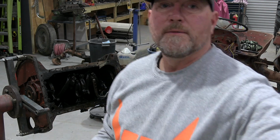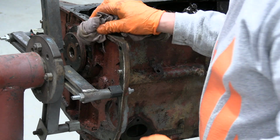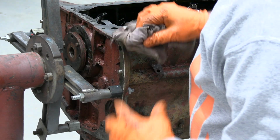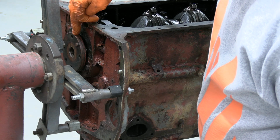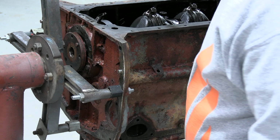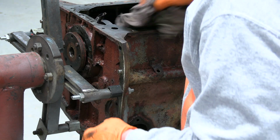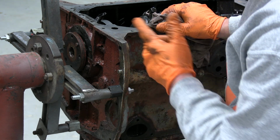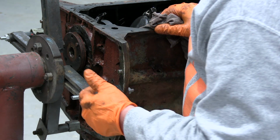And I'm going to adjust the tappets anyway, but it's always better to put things back where they came from. So the last engine I took apart, I did question whether someone had been at it, and on this flange on the crank that the flywheel attaches to, someone has ground a big lump of it off. I did ask if anyone knew whether that was standard or not, but this one hasn't got it, so I'm assuming that someone had done that to change the seal.